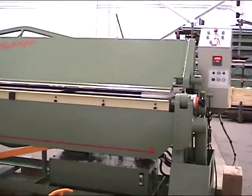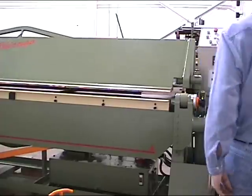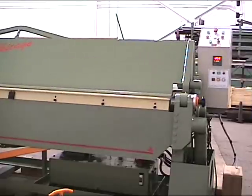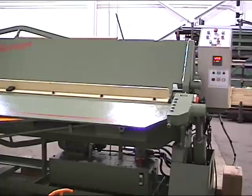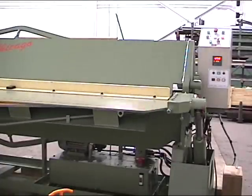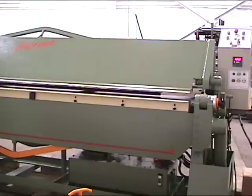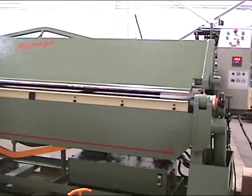Turn the machine on and operate it through one automatic cycle. You do not want to run the machine in a complete automatic cycle — you could use the foot switches in the front instead. Insert the material and clamp it using the foot switches, then go into automatic mode. It will pick up the bending leaf action and unclamp the top leaf upon completion of the bending leaf cycle, which allows you to grasp the material as the top leaf is opening.